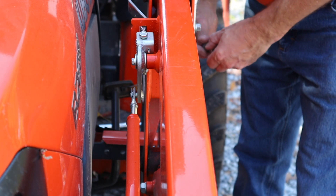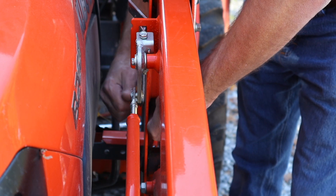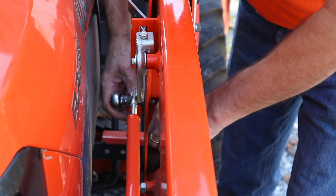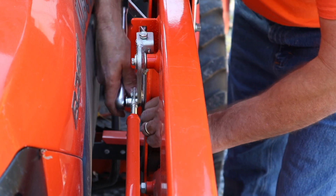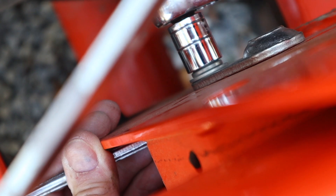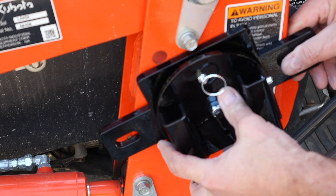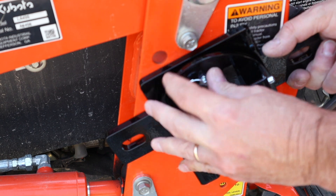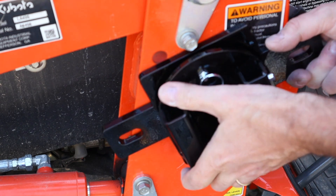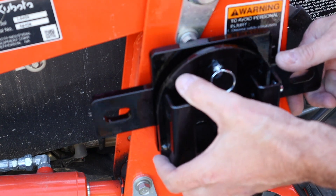Fortunately, there's a hole already in place back here, so it looks like these pins are made to be used on either the inside or the outside. The beauty of this SnapLock base plate is that I could mount this on an angle where it's nice and flat, and then I could pull this pin and rotate the base plate so that the saw sits straight up and down or wherever I want. But since it's easy enough to do, I'm going to move this pin too — that way I have this whole surface where I could mount this.